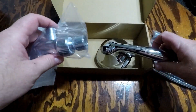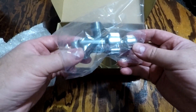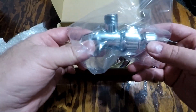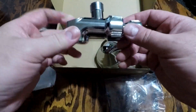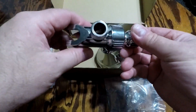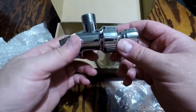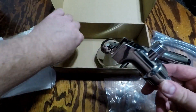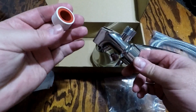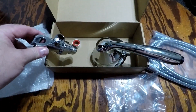This is the adapter to fit on your shower pipe that comes out of your wall. This is actually made of plastic — it's not actually a chrome piece. When you put it together, you want to make sure you don't over tighten it because it could crack. It also comes with Teflon tape so there's no leaks on the threaded pipe.